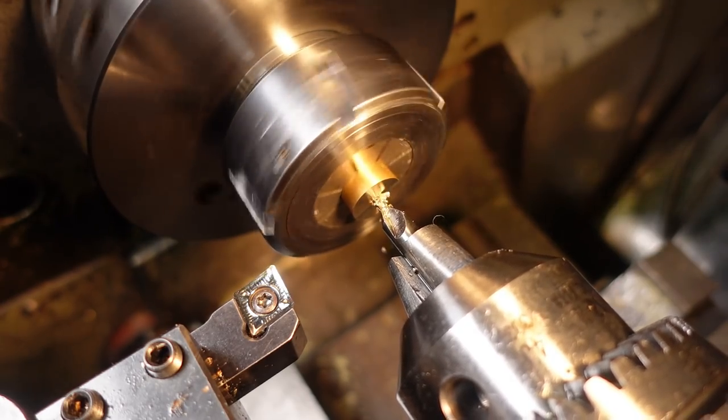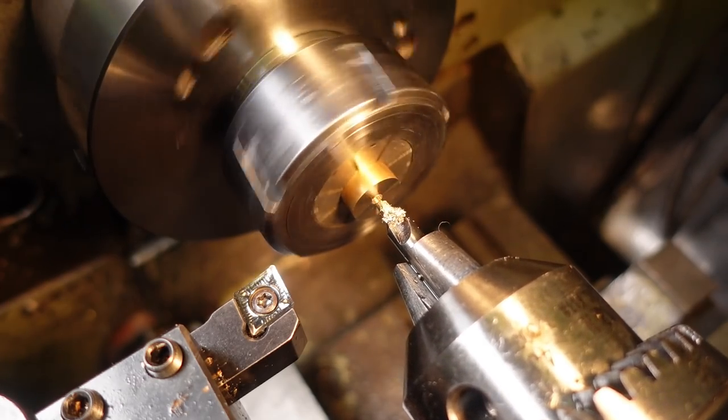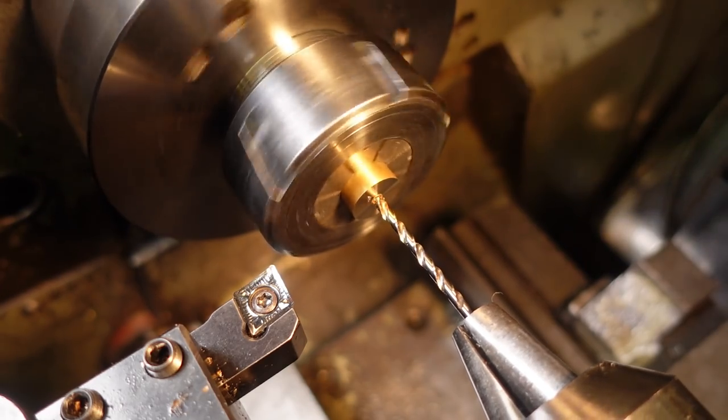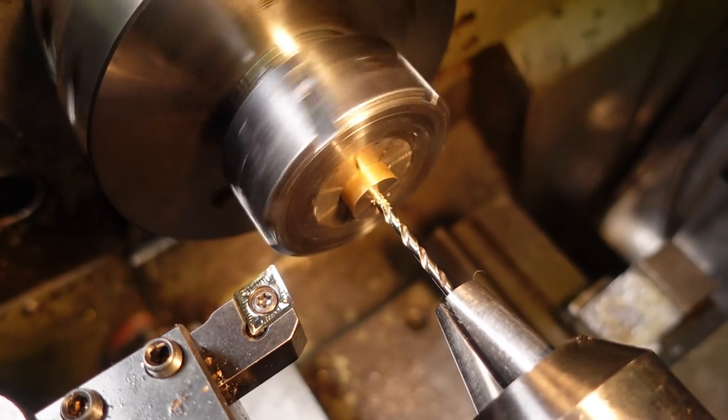Holding those 7mm stainless threaded inserts for machining the parted off ends isn't straightforward, so I'm making a collet with a pocket 7mm diameter and 3.5mm deep. That's enough to allow the 4mm unthreaded collars to be faced off and deburred.